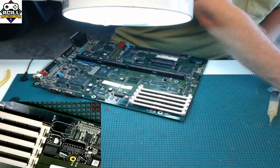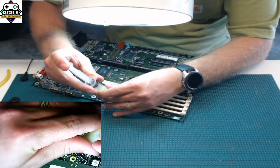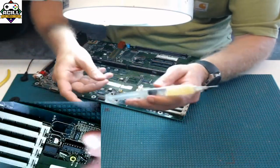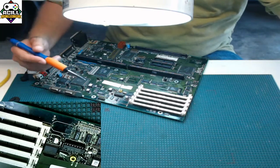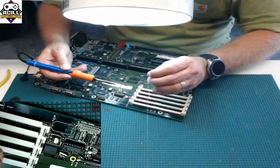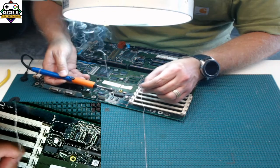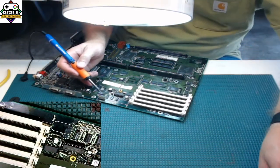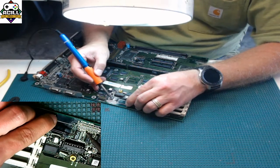So I am going to show you the drag soldering technique now. Again, flux, super, super important. Don't be shy with the flux. Next tip, take your iron. I'm going to do it inside here so you can see. I'm going to preload my iron's tip with some solder. So I have a bubble of solder on there now, and drag soldering is just that. I'm going to take it, I'm going to put this on. Can you see? Yep, you can see.